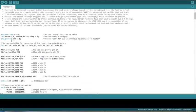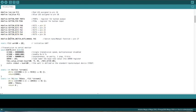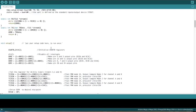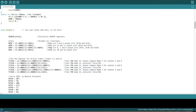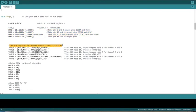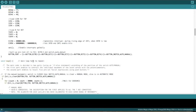Briefly, this is my Arduino sketch. I started by defining some of the variables, the five push buttons for the facial expressions, and the on-off switch to toggle between Auto and Manual mode. This is the setup for the transmission with the serial monitor. In the setup code, I defined the seven output pins for the servo motors and defined the pulse width modulation for the positioning of the servo motors. Initially, the servos are driven to neutral position, with maximum and minimum values defined.